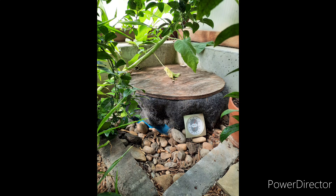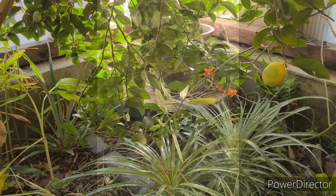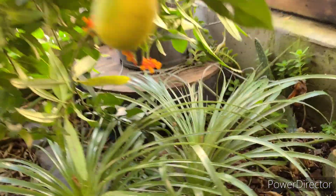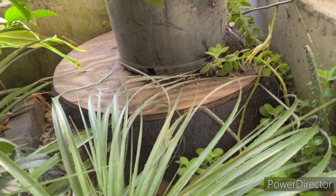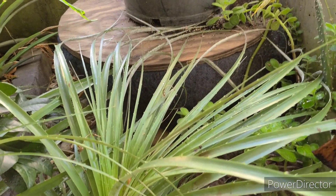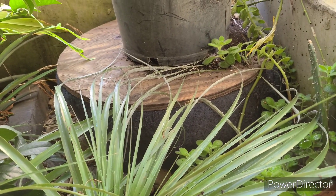We have intake points where a turbine fan pulls air from inside the greenhouse down into 1,300 feet of tubing going nine feet into the ground, backfilled with aggregate rock and sand, which acts as our climate battery storing heat.